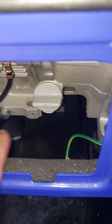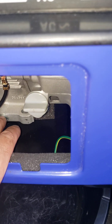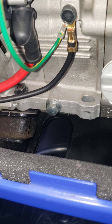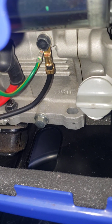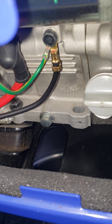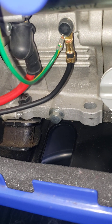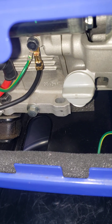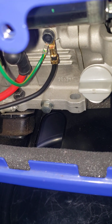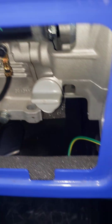You take this plug out as shown. Here's a drain plug, here's a filler plug. The drain plug has a crush gasket on it, but since this is a brand new generator that's never had an oil change, we're going to reuse that aluminum crush washer. You want to tighten these only to 10 foot-pounds. If you use a torque wrench and tighten them to only 10 pounds, you can reuse that aluminum gasket 10 times, and the drain plug could be used 100 times. Use a torque wrench if you don't have experience, so you're not over-tightening and damaging things.